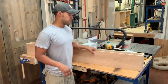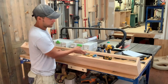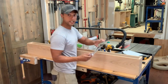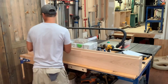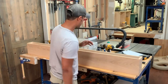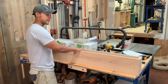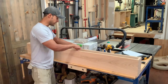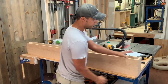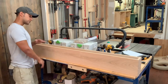To save time — you've seen me do it many times — I pocket-screwed a nailer board to the back. That nailer board has two functions: number one, it helped me keep everything square so you can see the miters are perfectly square with a nice tight 45-degree angle. Number two, I have something to screw this to the wall with. I'm going to put a spacer block in here to stiffen it up a bit, though it won't really matter because there's going to be a shelf top on it with a three-quarter inch overhang — also solid three-quarter oak — and then we're going to stain it and spray it with polyurethane.